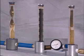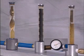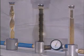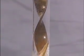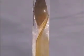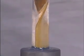As the coolant pressure for each of the three baffles is equally increased, the higher pressure appears to have little effect on the coolant flow with either brass baffle. Each of the brass baffles has a 20-thousandths clearance per side. The clearance on either side of the baffle blade is required to permit installation into the cooling channel as the baffle blade is turned into the threaded tap. This gap between the edges of the baffle blade and the gun-drilled wall permits blow-by.